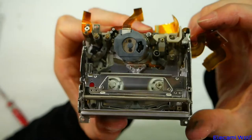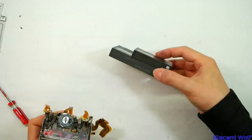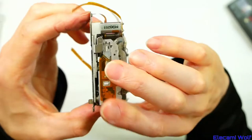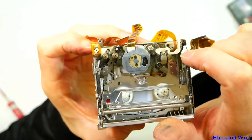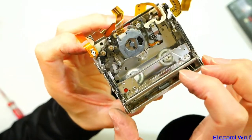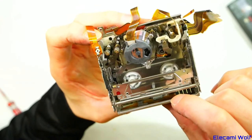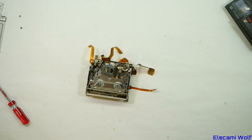And the last one — we have a mini DV, which uses quite small tapes compared to the 8mm tapes. Everything is microscopic in this and it's difficult to work on. You can see a very small video head there. It's probably in the threaded position — it probably doesn't have a choice because it will unthread when it ejects the tape. These are delicate and temperamental. That's a brief look at some VCR tape mechanisms.